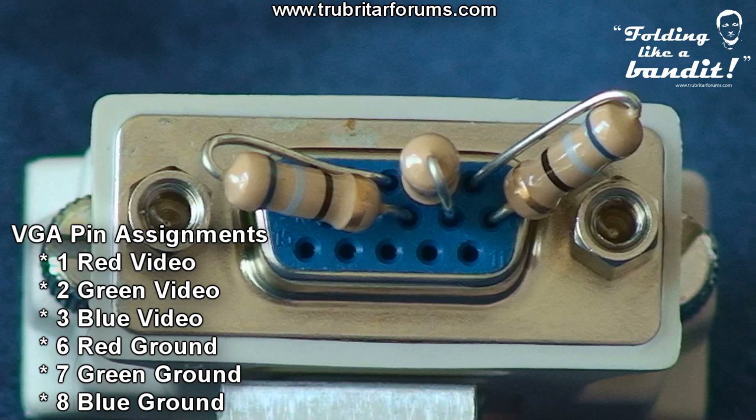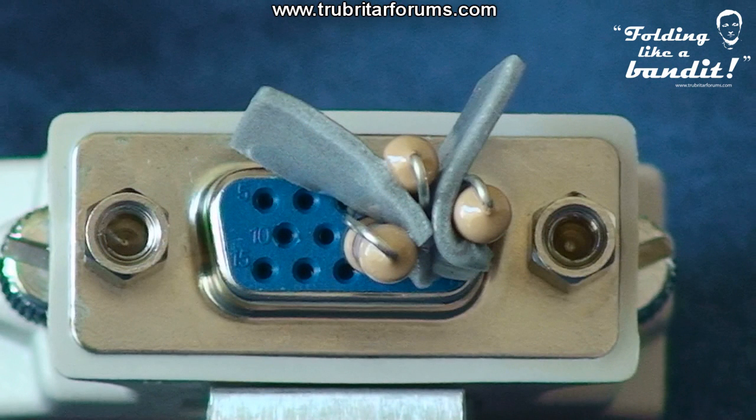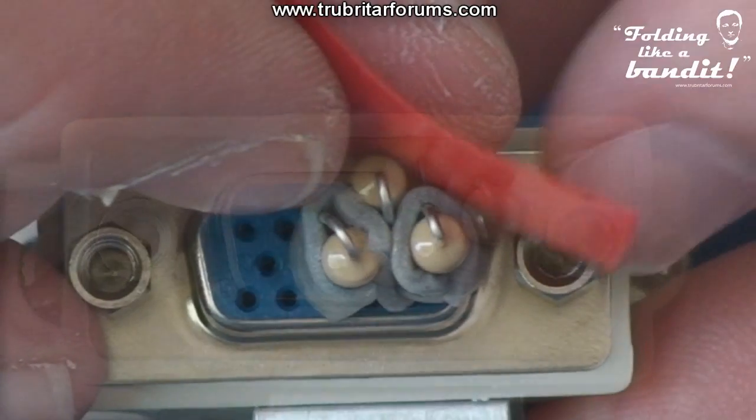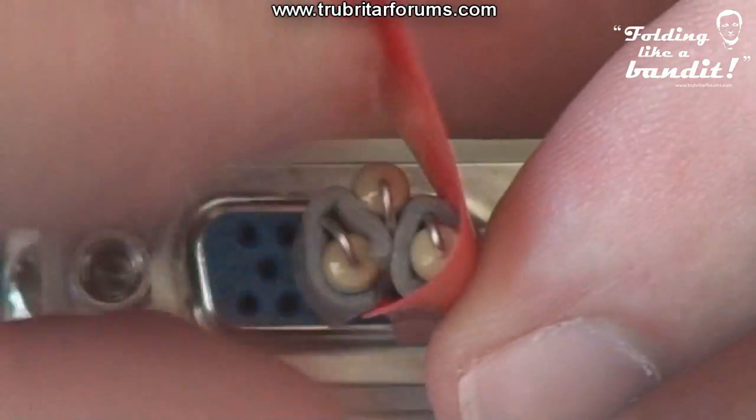The main reason for installing the resistors in this manner is to ensure we can pull them together as tightly as possible on the back of the VGA adapter. Take your double-sided adhesive pads and place one in between each resistor to stop the wires from shorting out and keep the resistors secured. Straighten up the resistors, fold the adhesive pad all the way around them, and finally install some electrical insulation tape to stop those wires from shorting out.